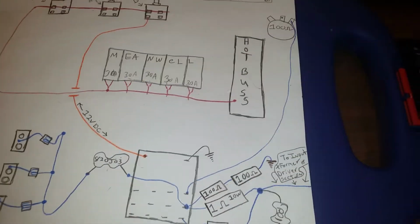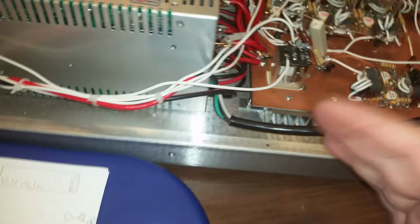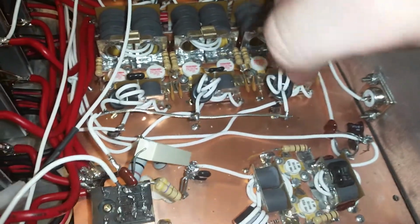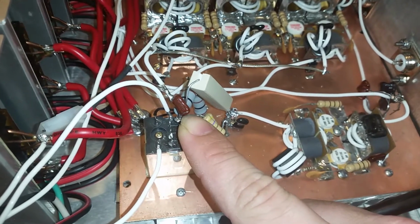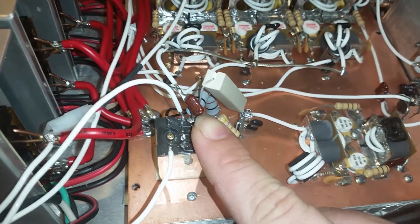And hey, man, I'm a guy that's all about learning. That's why I drew this circuit out, man. There might be something I'm missing here, something I can learn here, but the way it's looking here, if this was going to be something, there needs to be some inductors, and there is no inductors. You got a cap right here, which is an 820 picofarad that's taken onto the chokes right here to the back of the transformer. DC voltage cannot pass through a cap in series. It just won't happen. It's impossible. Only AC flows through a cap in series. We use them for blocking DC.